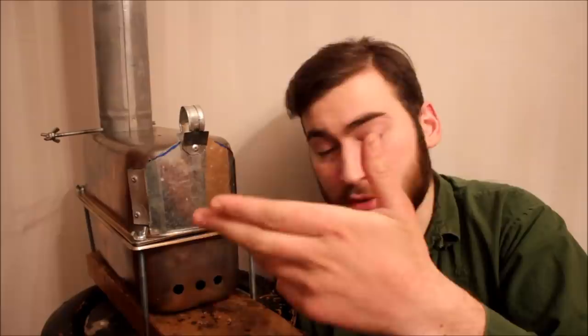of work. If you want my advice, I would recommend using cobalt drill bits to drill the holes, because this is stainless steel. But even if you don't have those special drill bits, regular drill bits will work well if you put some tap oil on, and go slow. Don't rush it, because you will overheat it, like I did over here when I was making the big hole. But if you go slow, you won't have any problems.